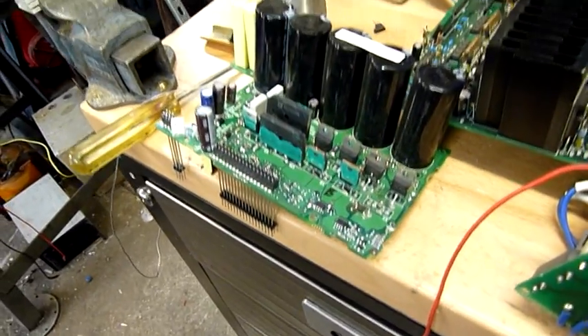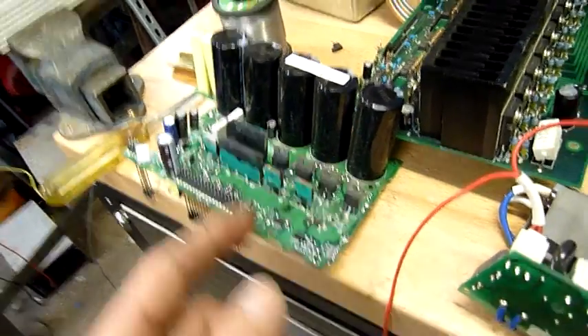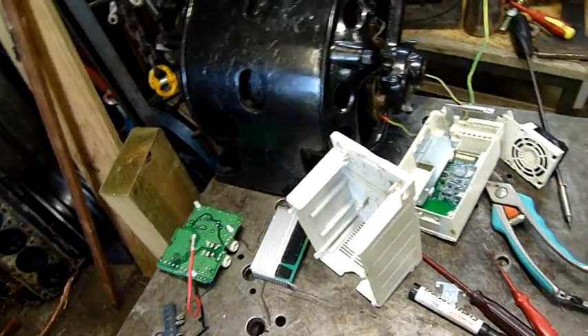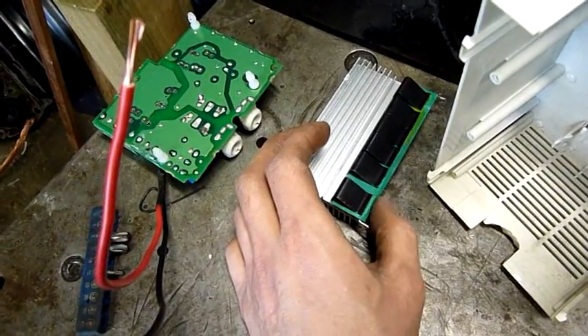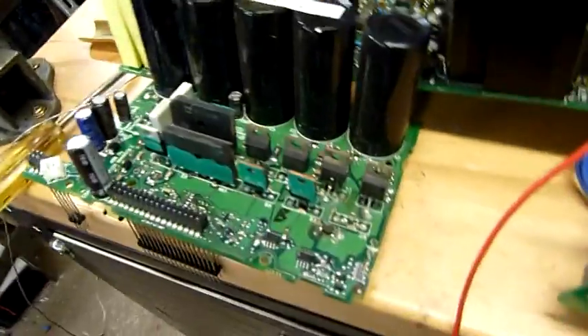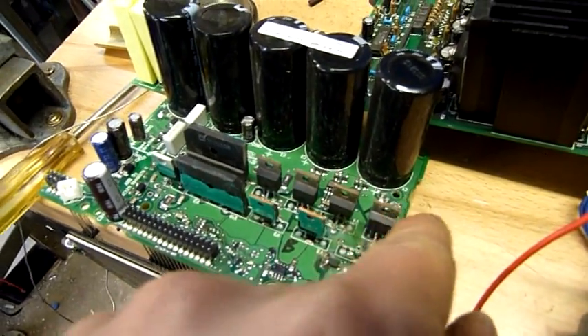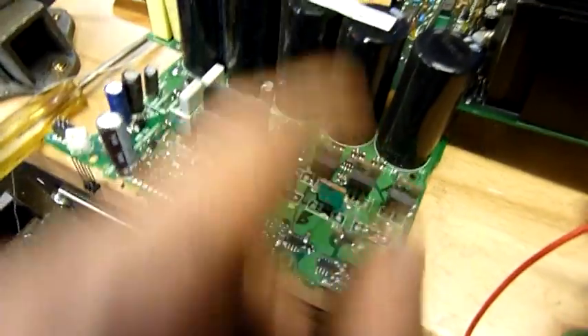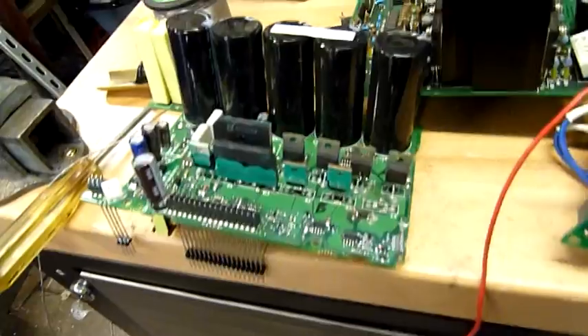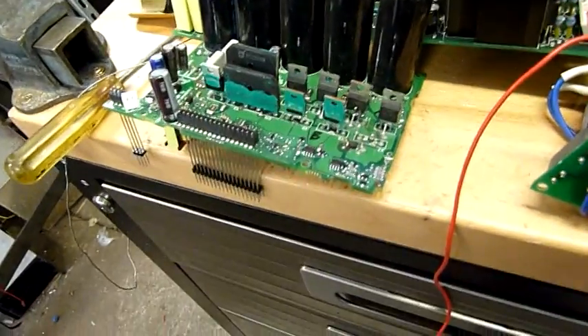I'll set it up on the test bench — sort of half remote board. Instead of soldering this backing board hard on, I'll just run bridging wires to it and have it all laid out on the bench. I'm probably going to have to get new insulating material because the backs of these transistors have to be insulated from the heatsink. One side's positive, one side's negative. The center pin on these is this metal backing, and you don't want that contacting the negative side that this heatsink seems to be on. So I'm going to have to make sure all of that insulation is intact — that's another thing that may have failed. Maybe the insulation burnt through and caused part of a short.